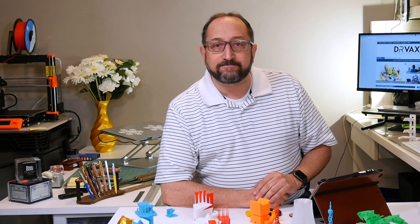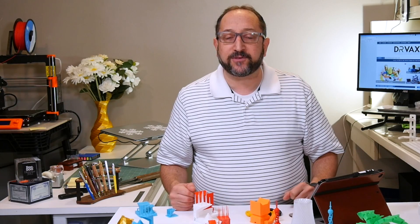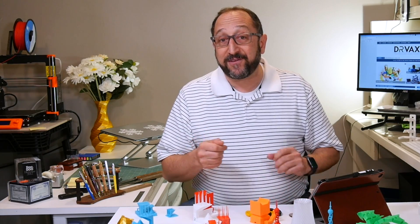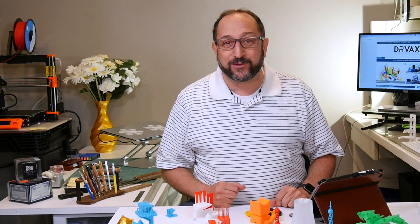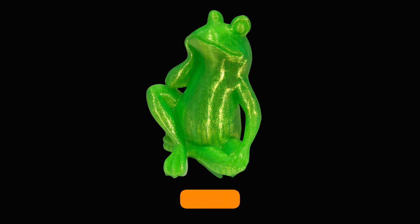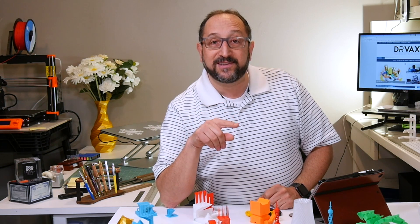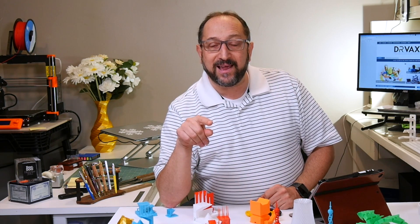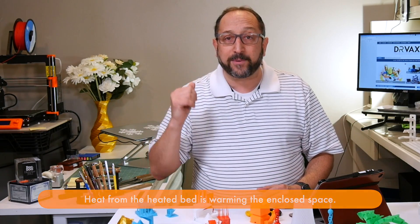What about materials? I think it's a draw, with some nuance. The Ultimate II is going to be a better ABS printer — I haven't personally tried ABS as I print in my basement and avoid the fumes — but I do use a lot of PETG, PLA, and TPU. If you need an enclosed, consistent temperature environment, the Ultimate II has an advantage. But that advantage can become a disadvantage with some PLAs, where you may have to open the door and even turn the heated bed off for upper layers.